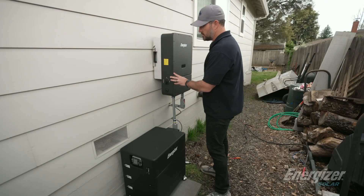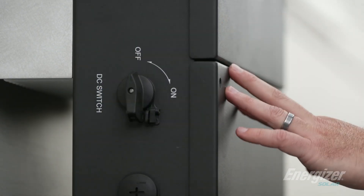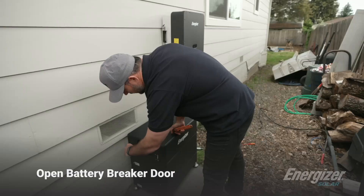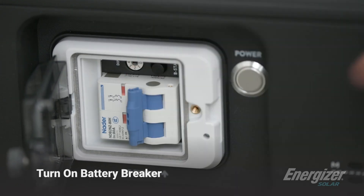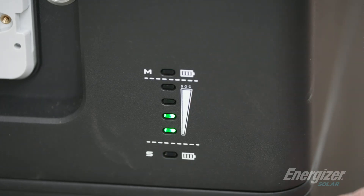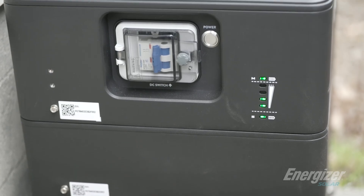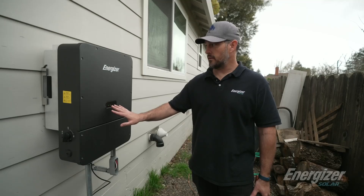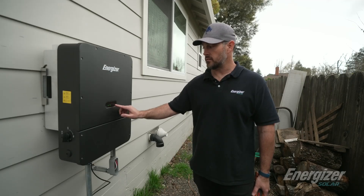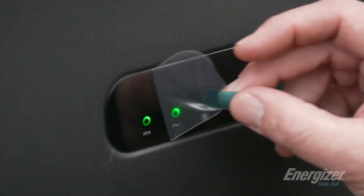When energizing the system, if you have solar coming in, this is your DC switch. Since this is an AC coupled system, we're leaving this in the off position. To energize the battery, open up the breaker, turn on the breaker first. Once that's on, press this. Now you can see the lights starting up — you can see each of them are communicating, these green lights turning on. After we've turned on the grid and turned on the batteries, the inverter was initializing and now it's connected. Solid green is good. If there is an error in connection, there would be a red light here. Right now everything is on and communicating.